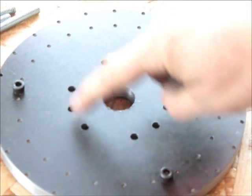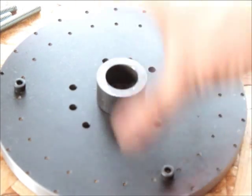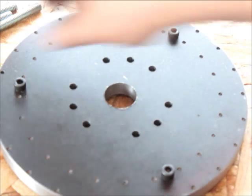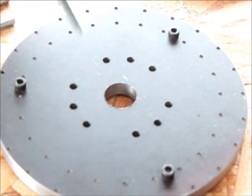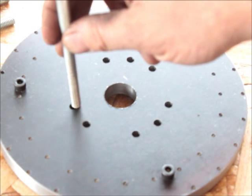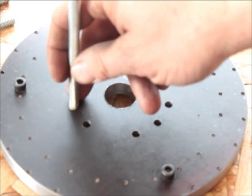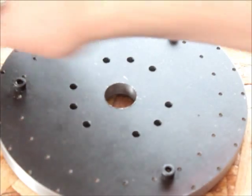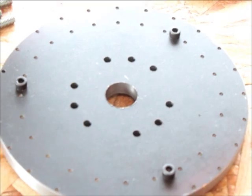Those six bolts are these right here. Once these are pulled apart, that's how you're going to hold it together. The other three are the jacking points. This is 5/16ths coarse thread — what I'll do is thread that out, put a nut on the other side, and then that will be MIG welded down to it. That way I can lower the one plate onto the other safely, which is very important with these things.